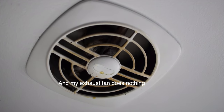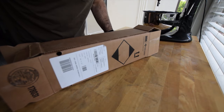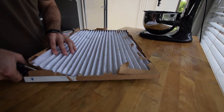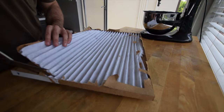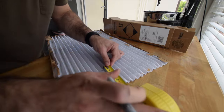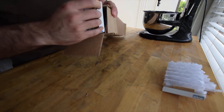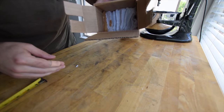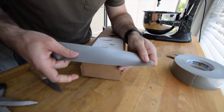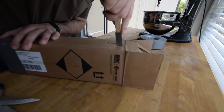Most of the stuff I use to build this will be linked in the description below. To build my smoke filter, I'm using standard furnace filters and a cardboard box. I ripped off all the exterior cardboard before realizing that step was completely unnecessary. I measured out and cut up pieces of the filter the same size as the box, then stuffed as many as I could comfortably fit — about 10 pieces. I sealed up the seams with duct tape to prevent leaks, and cut out holes in the end to allow smoke and air to flow through. If it works, I'll have to replace this entire filter regularly.